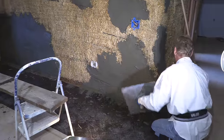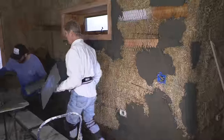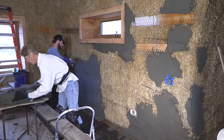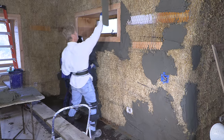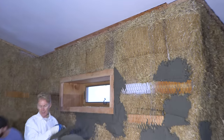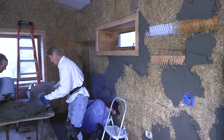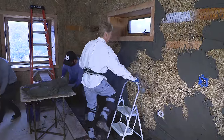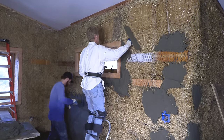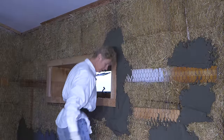Jay and I are in the Oakland area. These guys put all the wire and tacked it on there — that's a job within itself. Now I'm going nine inches there. Here's something — that's about eight inches deep there too. So just to prove a point, I'm going to do this. Mackenzie's using those buckets. Had I known he didn't have a hod, I would have brought a hod. This is going to take a lot of stucco, so I might as well put some up here now because we want this to set up.